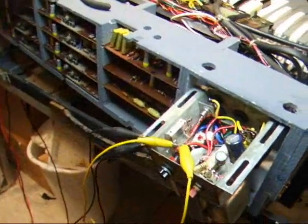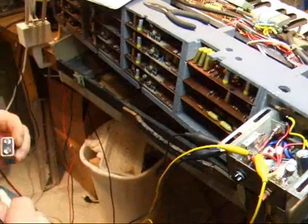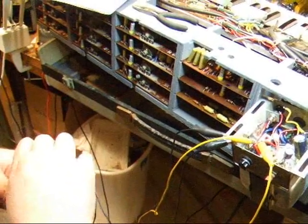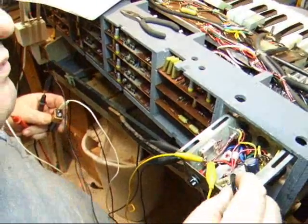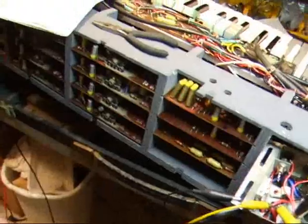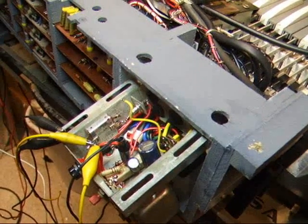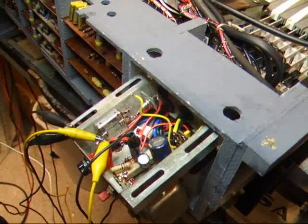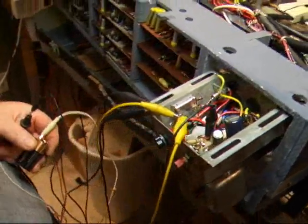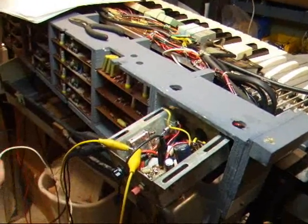Directly to the battery positive. It's 100 milliamps — one-tenth of an amp, not much. Under the circumstances, the 7809 got unusually hot real fast. I'm not sure why the situation is there. It may be that I don't have a heat sink on it, and that's not helping any, but it's 100 mA.